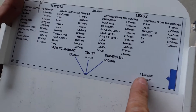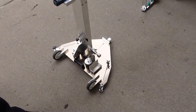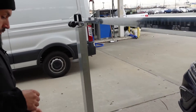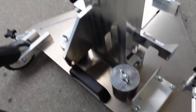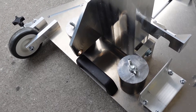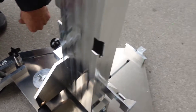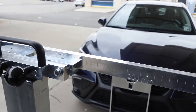So back to the board: we need Toyota 1350 on the height and 1077 from the bumper. All you do is swing these up, pull your pins — nice and light, everything is easy, one finger. This is all CNC billet material. You can add these weights — they're five pounds each — to get the stand stable when using a Subaru or full-size target. We used Subaru outside with the weights and it worked perfectly. There are also extenders, and you can do adjustments here for leveling. There's a leveling point at each front corner.